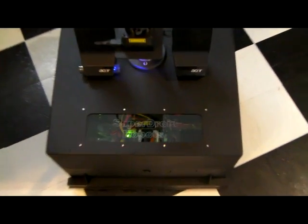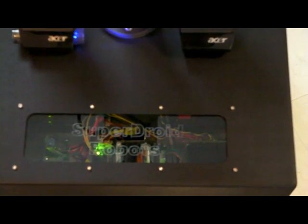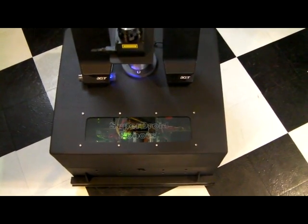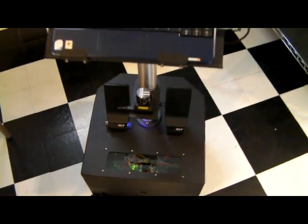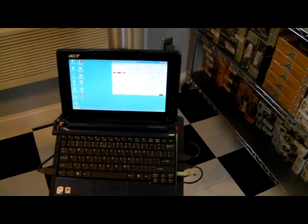In the base of the robot is our onboard microcontroller that controls the robot's drive functions, camera functions, and turns on auxiliaries with optional encoders. It keeps track of the distance you've traveled, has front and back sonar, and a front bumper switch — all of which is fed back to the laptop.